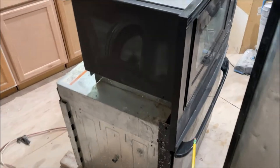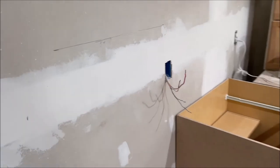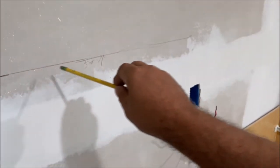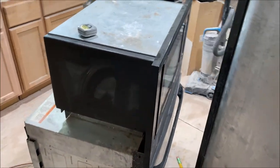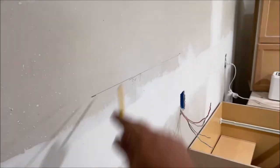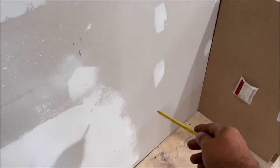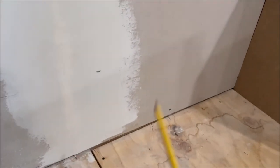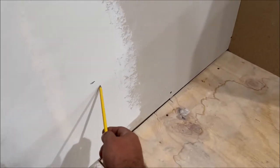You have to decide where you want this. In my old kitchen I had the microwave sitting above the wall cabinets, but I actually did that wrong. This time I'm moving it down so it does not exceed the wall cabinet height, and I can run a wall cabinet on top of it — that's how it's supposed to be designed. The real oven back there is low anyway. So we find our wall cabinet line, measure the exact height of the unit which is 42 inches, mark 42 inches down, and there it is — almost exactly one foot from the floor.